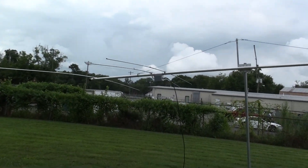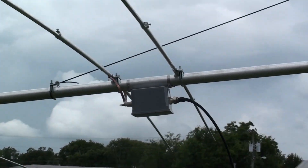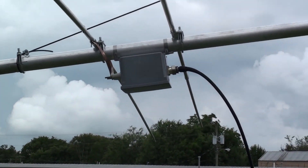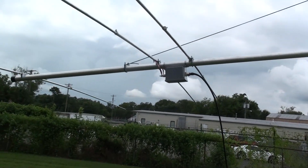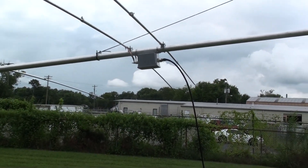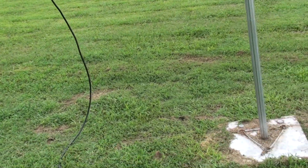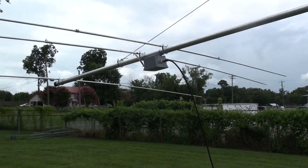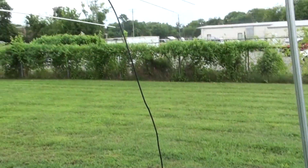There's a look at it. Now that box you see hanging on the bottom of it — that's an interesting topic in itself — that's a 30 kW balun, whatever you want to refer to it as. They have been tested up to 30,000 watts carrier, not intermittently either, regularly tested. We've got a tuning jumper coming off of it here, and that's what the antenna was tuned with.